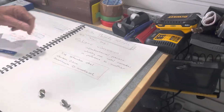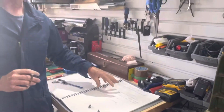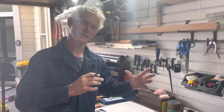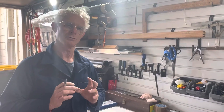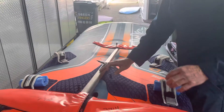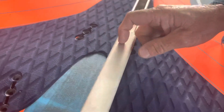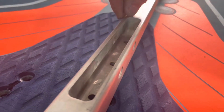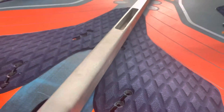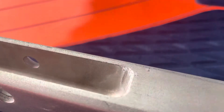What we have here is stainless steel, carbon fibre, and aluminium — which we know is anodized. But when you put dissimilar metals into an electrolyte — in this case salt water — the less noble metal will start to corrode. Looking at this IQ race fuselage, you can see through the anodizing a whitish corrosion, particularly around the corners, because aluminium is the less noble metal. In salt water with carbon fibre or stainless steel, the aluminium will basically start to eat itself away.